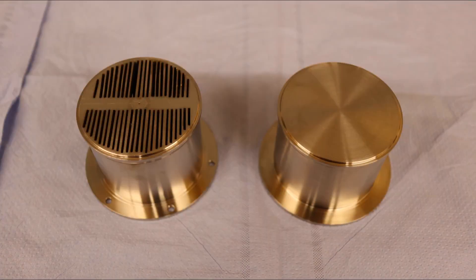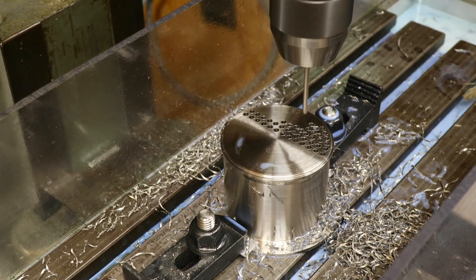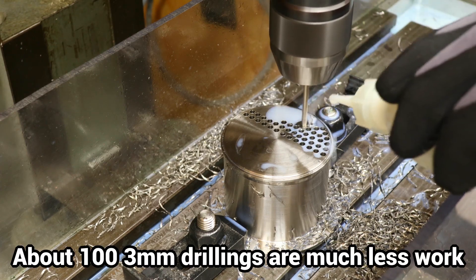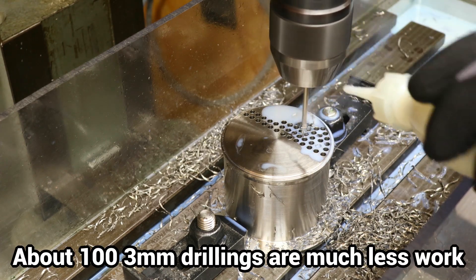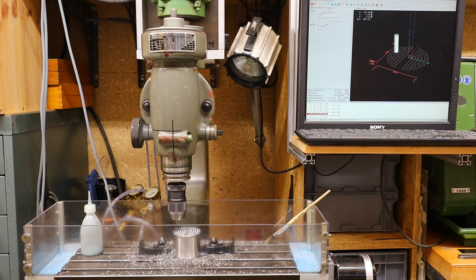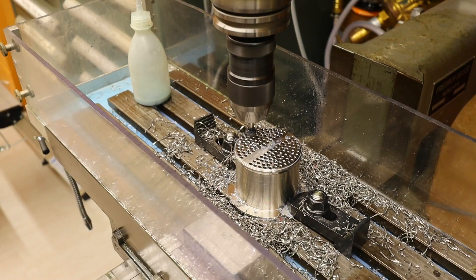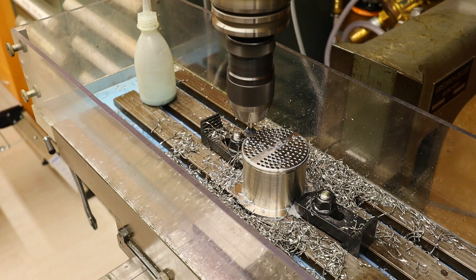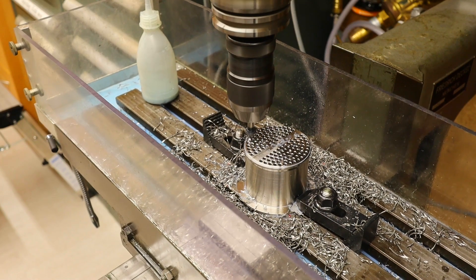This is a job I don't want to do again. While the EDM was still working, I was already making the next version of the heater, this time for drilled gas passages. Narrow slots offer much better heat transfer than easily produced, not too small holes, but three weeks of problematic eroding every evening compared to two hours of simple drilling really does make a difference.